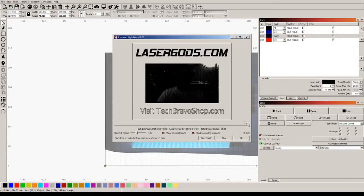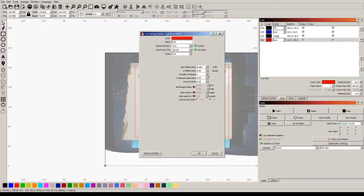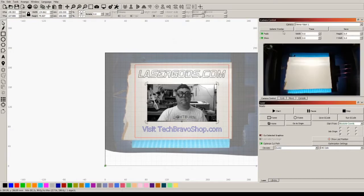Yep, only once. I think I'm going to have to do two passes on the outside to actually cut through this stuff because it's got a lot of glue in it. I'm going to send it home and recapture the overlay, update the overlay just to make sure it hasn't shifted. Already checked my focus, turned on my air, got my exhaust on, water's on, I'm at 20 degrees.